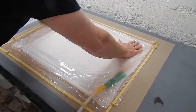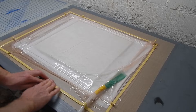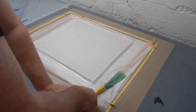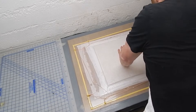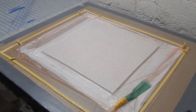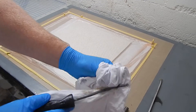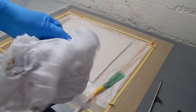Here comes the bag with a little bit of vacuum pulling it down. I'm not going to put too much vacuum on initially — maybe later I'll bring it up to about 15 inches of mercury, which is about halfway, just to see what happens. For something like this you typically wouldn't need much vacuum. Here it is all laid up. It's on a warm table at about 85°F and I'll let this sit until it cures. You can see the resin bleed through in a nice pattern. Before I walk away, I'm going to clean off my wet out roller, making sure there's no resin inside the barrel of the bubble-popping end.